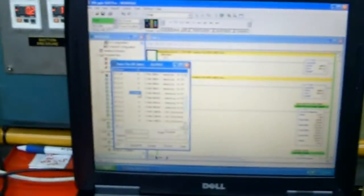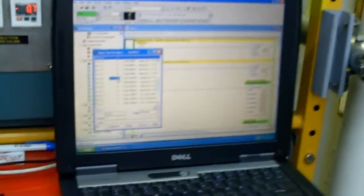Making a little bit of progress on the programming. I have some work to do on that — that's going to be another big thing coming up. We're trying to get a program written to shake the ash grate shaker. The switch is wired in the back here through the PLC, so when I flip this switch you'll see a contactor inside here pull in. There's an input that lights up when I flip the switch and it fires an output to pull that coil in, which is what's turning that motor on.